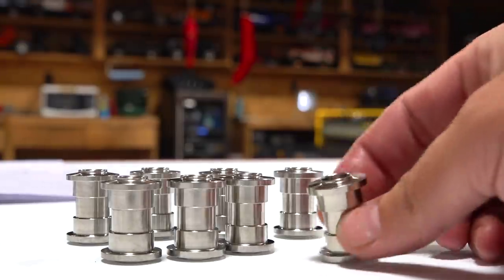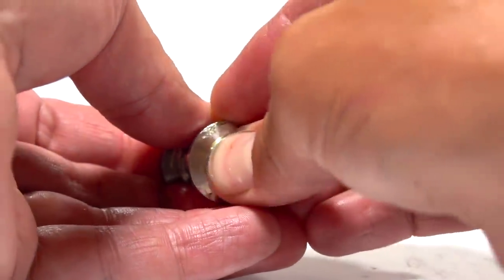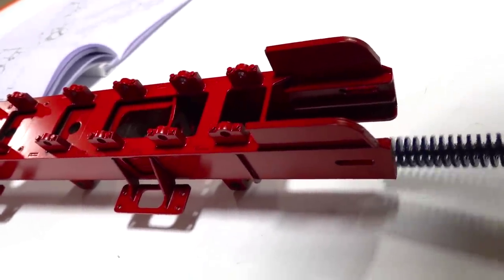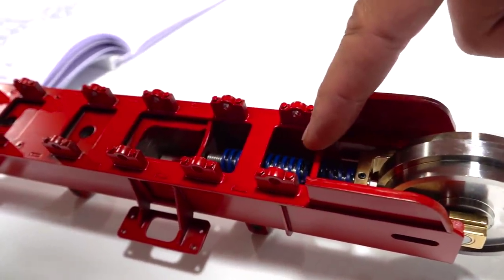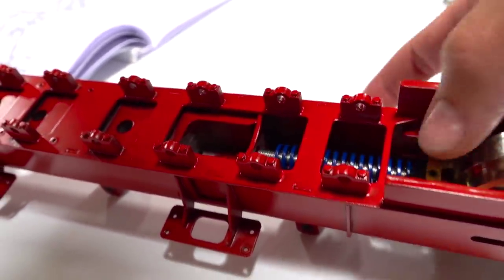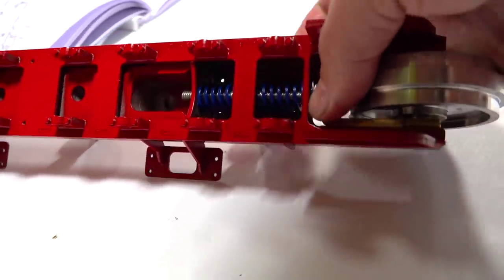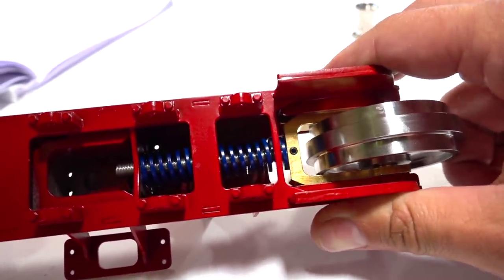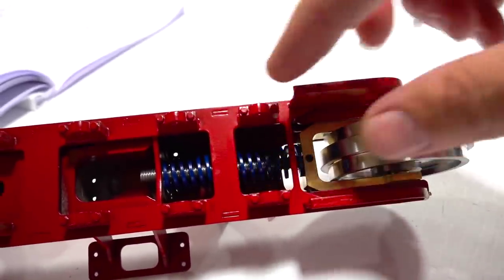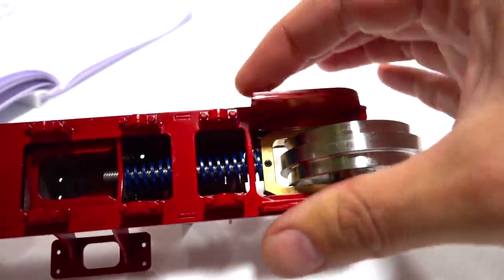Enter the bottom rollers. With proper grease on both sides, before any rollers are installed, I have to put the idler wheel and tensioner in place. It goes through here and through here, with a hole in the final piece, adjusting it so we can get it in place. Then I put a nut on the end to adjust the tension on the track — so if a rock gets inside the track, this idler wheel can move and it won't break the actual track itself.